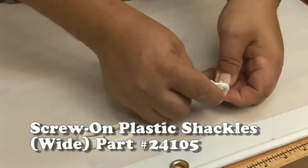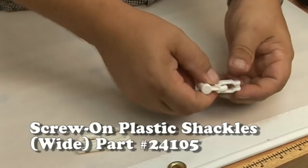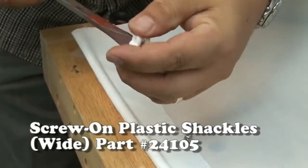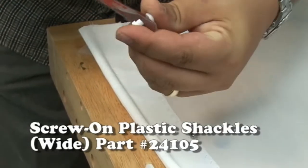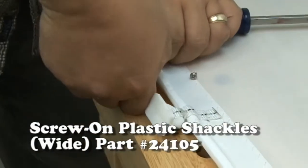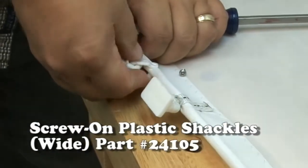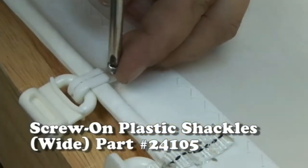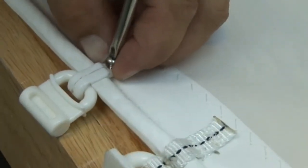This one's a little bit stubborn because the plastic is so thick. We recommend that you take a screwdriver and pre-bend this open, otherwise you'll have a hard time getting it over your bolt rope. So I'm pre-bending it here — now it's a little bit easier to flex onto that bolt rope. If you don't do this, you may find yourself spending 15 minutes to install just one.